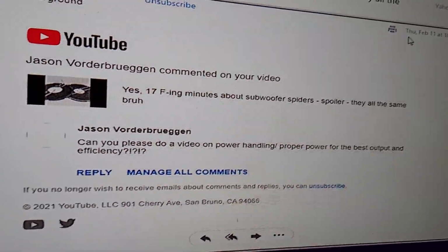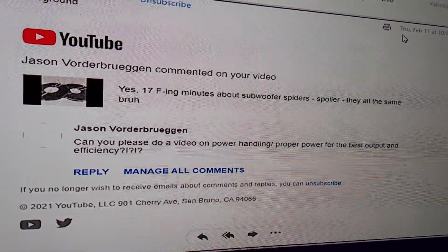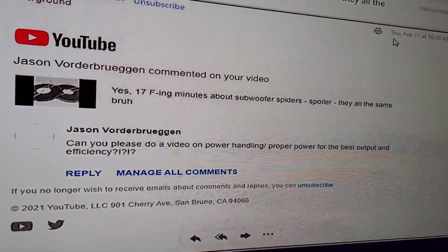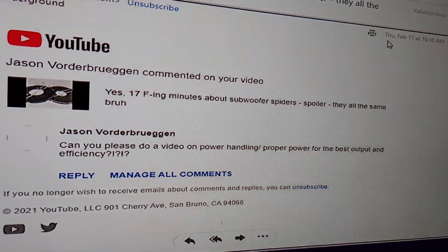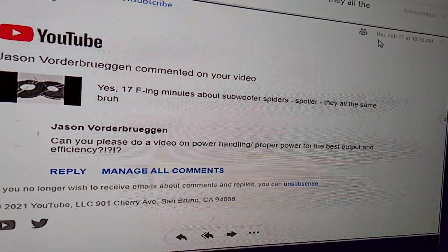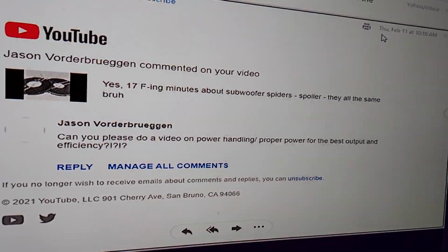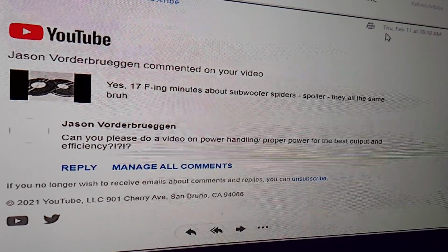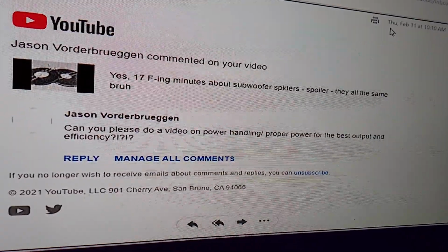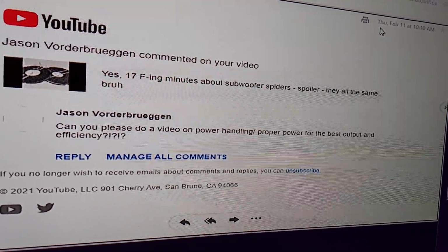So some companies are conservative, like Rockford. They have their new Monster T2 that they rate at 2,000 watts. And it does like 5K, because Cerwin-Vega Mobile uses the same motor, and they used it on the Stroker Pro, and they rated it 5K. So even that's conservative, depending on the size. Some companies, I've noticed like Sundown, rate it based on the motor size and the coil size, not on the acoustic load, which, whatever, that's fine too. But Jacob is really conservative on all his numbers, like the ZV5 only handles 2,000 watts, bullshit. So it's good for, I would imagine, 3 to 4K at least.